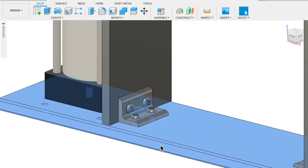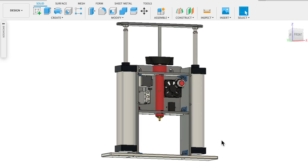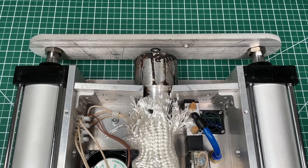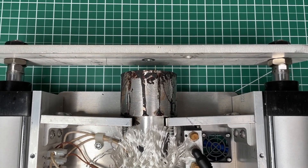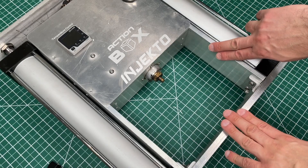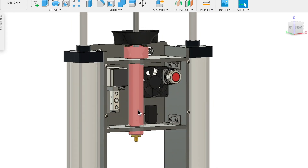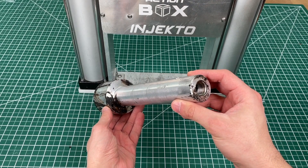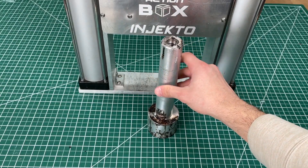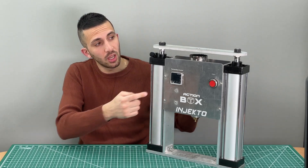Note that the frame pieces here are all held together with brackets. We used these brackets to make all of our connections and this worked out super nicely, now that they're perfectly tucked inside the box. It's also nice that this bracket acts as a shelf to support this bar up here, because it's exposed to very high stresses from the cylinders pulling right down on it. We decided to use standard 3-inch aluminum flat bar because it's one of the cheapest and easiest raw aluminum parts to get.